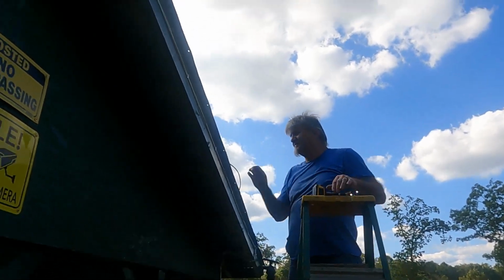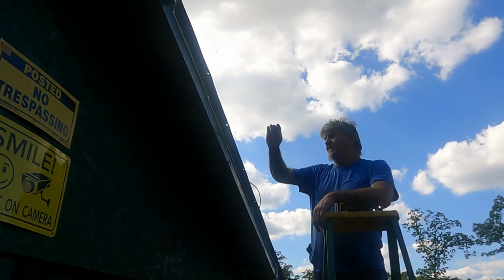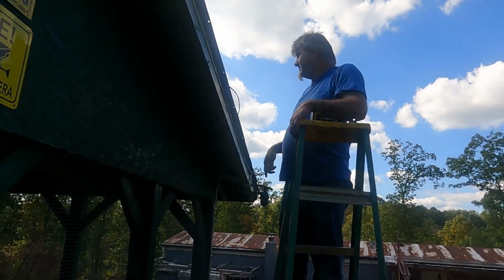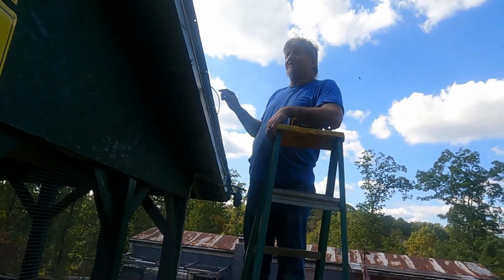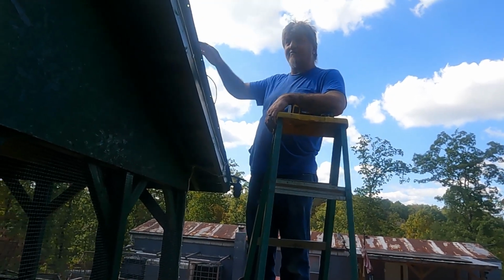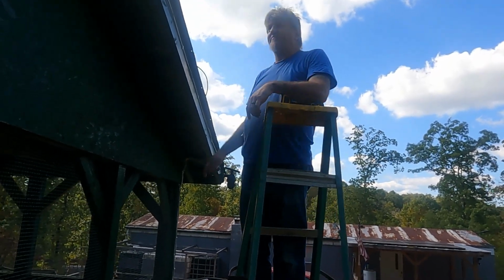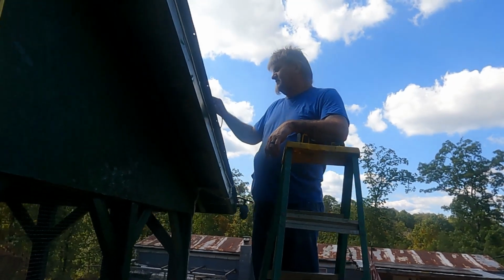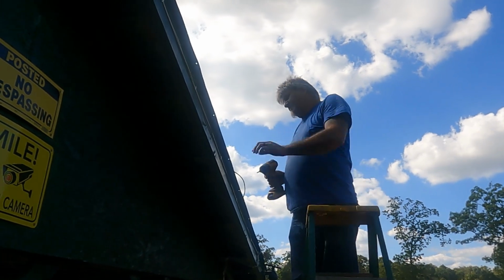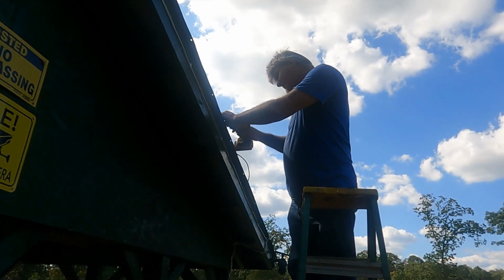What I'm doing is I got each panel wired together, grounded together. That one rail grounded together, this whole grill grounded together. Then I have one long wire going from that panel to the earth ground. Then from that one to the earth ground. The actual unit strut that we used to put them on the roof with, I grounded the wire to those, one on each one, one there and one there, run to the earth ground. Now what I'm going to do is wire the two arrays together, ground them together. And honestly, I can't do much more grounding than that.